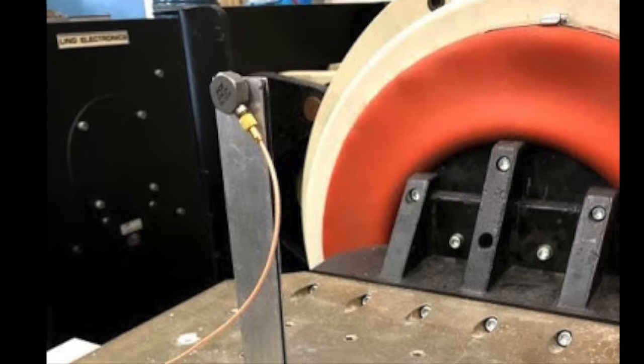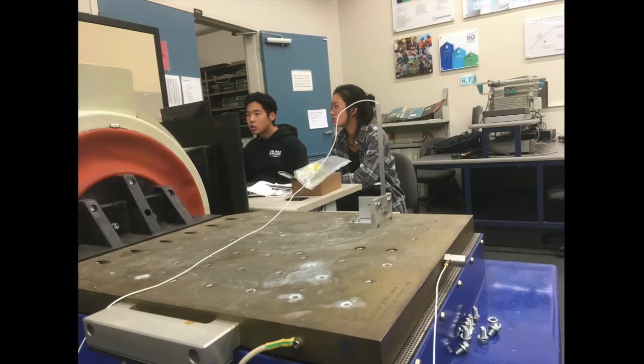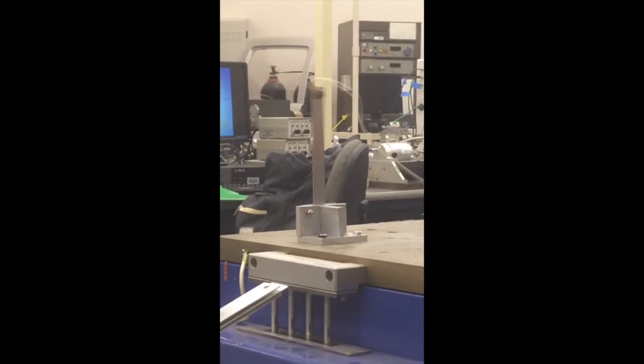Next, we use the shake table to find the damping properties of our prototype VEM, FlexSeal, per ASTM E756, measuring vibration damping properties of materials. From this test, we were able to extract the shear modulus and damping coefficient of the FlexSeal using sandwich panel beams.